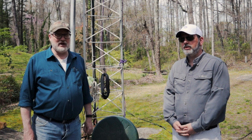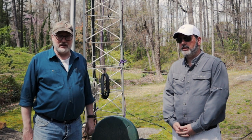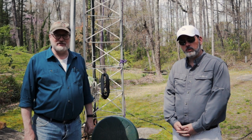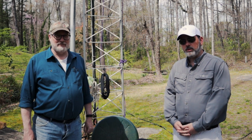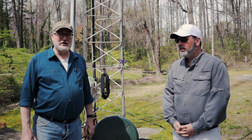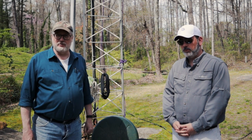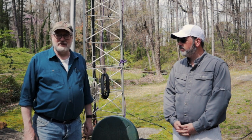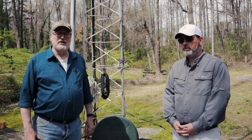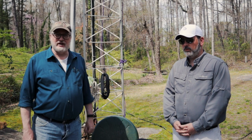And as I said, this is about the simplest multi-band antenna you can build. We're going to wind up with 2 pieces of wire, each one under 47 feet long, and a piece of ladder line about 39 feet, 3 inches, and that's it. And another great thing, it's shorter than the G5RV. One of the unintended good consequences of making the switch is that this antenna requires a little bit less room. Each side of the antenna is somewhere around 46 feet 8.5 to 46 feet 9 inches long. That will bring the whole antenna in at under 94 feet, somewhere between 93 and 94 feet.